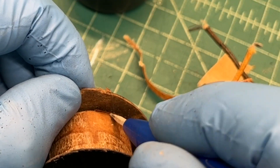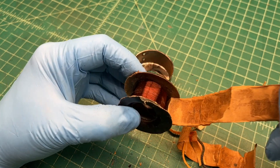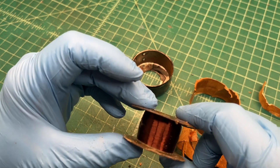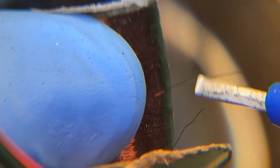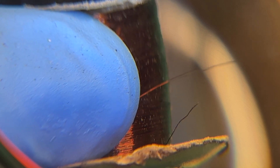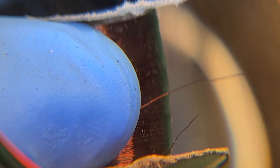I see one end of the wire right here. Now we're getting down to the bare copper — maybe I can salvage this thing. I may try to repair this. This is the most inner winding, best I can tell, and the outer winding here. Let me see if I can secure the outer winding and then attach a new lead at this location to see if we can get any DC resistance here on the existing coil.